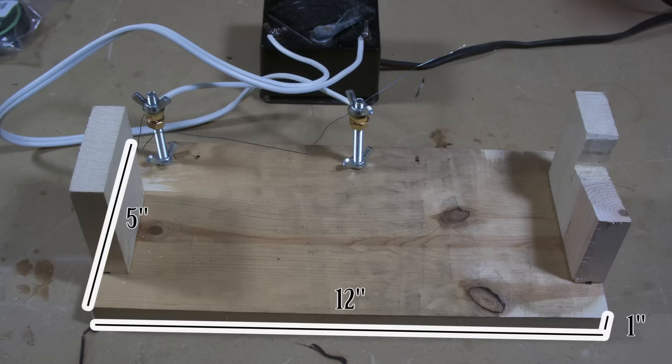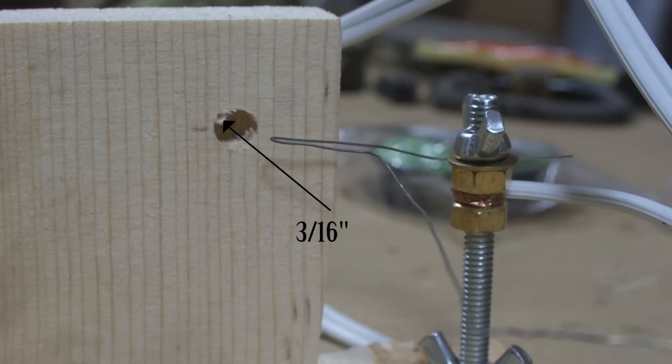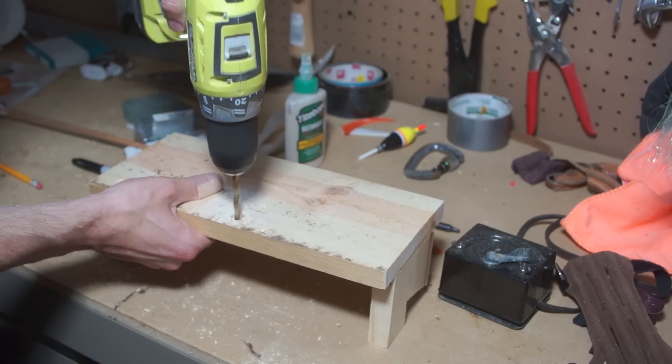The dimensions of the fixture aren't vitally important. Mine is just 1 by 5 by 12 inches on the base. I used Titebond to glue two blocks on each end of the platform. On one of the blocks, I cut out a V-shaped wedge with the backside being vertical. On the other side, I drilled a 3/16 inch through hole and also a 5/16 inch hole just deep enough to seat a carbon arrow shaft. Next, drill two 1/2 inch holes partially through the bottom of the base near the back edge — I made mine 6 inches apart. They need to be just deep enough to seat the head of a bolt. Then I drilled out the same partial holes the rest of the way with a 1/4 inch bit.